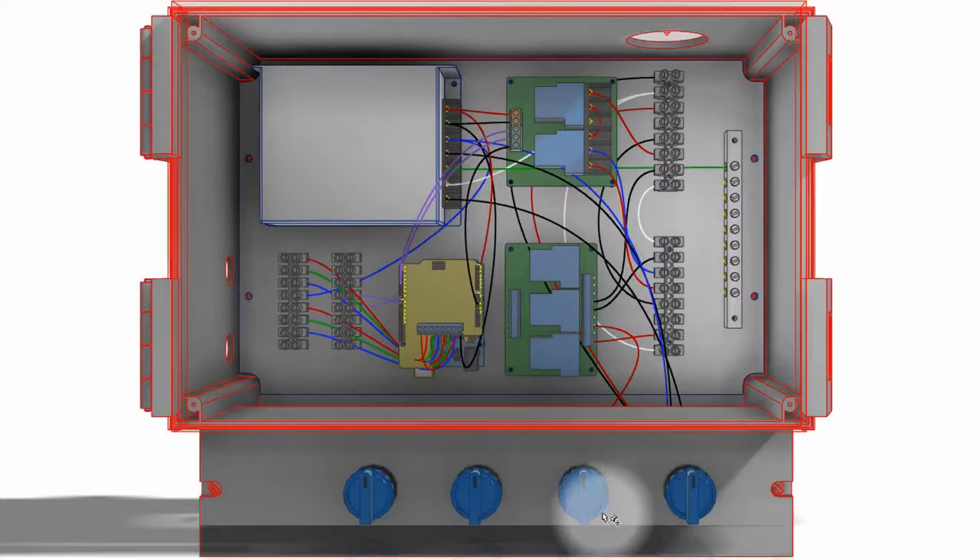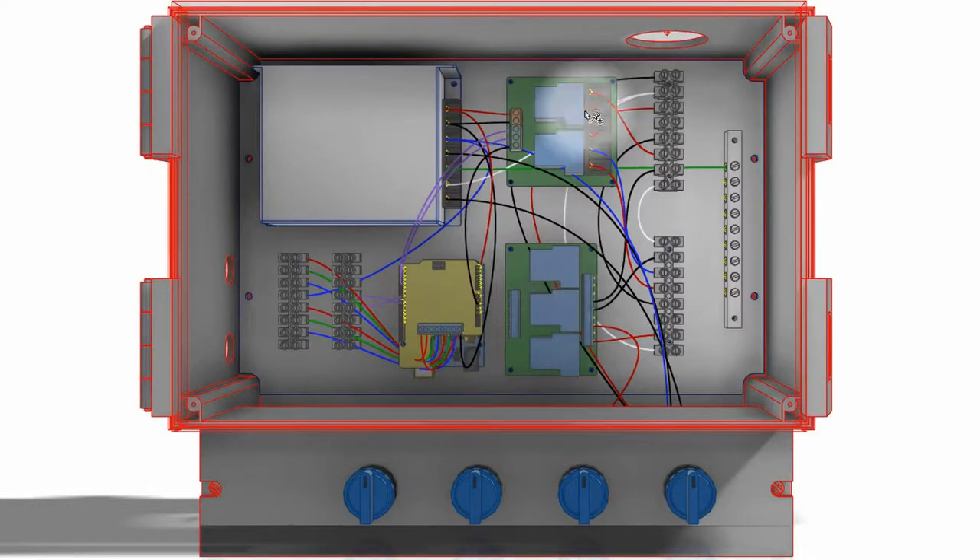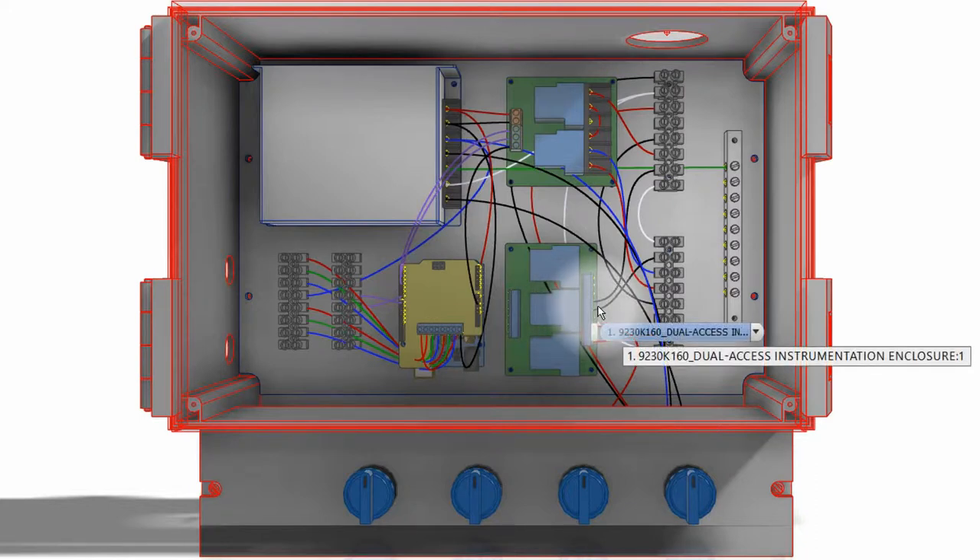We also have the lights on these industrial toggle switches. We have two relay boards: this double relay board switches the jet pump — the first relay switching it on or off, and the second relay toggling between low and high speed modes. Then I believe we're using only two of these relays here: one switches on the low voltage lights in the hot tub, and the other is a normally closed relay that can switch off the circulation pump.